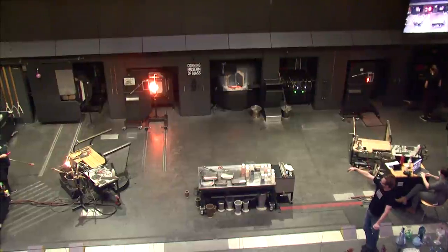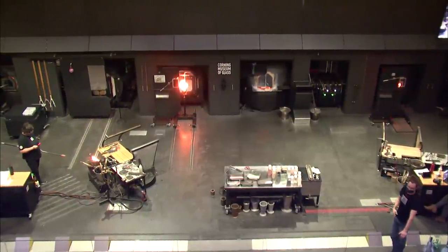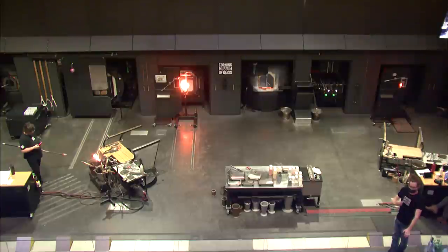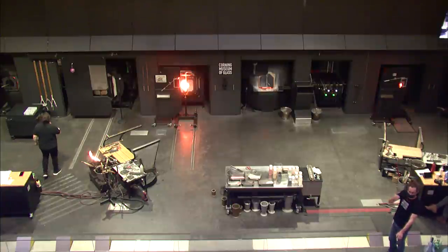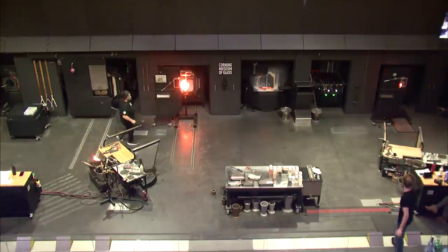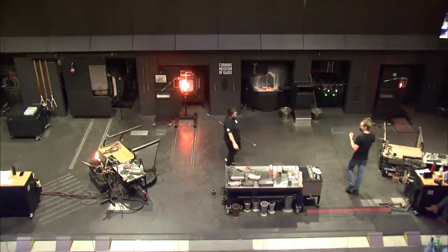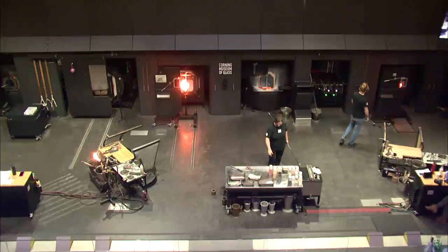But we do have a little shield on our heat shield. So in front of the reheating furnace, we've got that stand there, that heat shield. We kind of stand behind that just so we're not getting blasted with 2,000 degree heat all day long while we work. And in there, we have a little shield. It's a didymium lens, so it's kind of a dark purple tinted lens. And we can look through that, and that sort of alleviates some of the brightness coming from the furnace. Now, if we use those hot torches, sometimes we'll wear glasses as well.